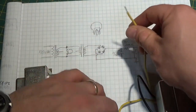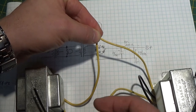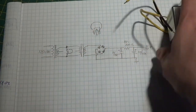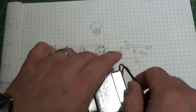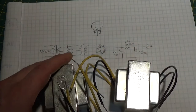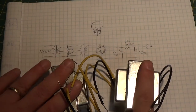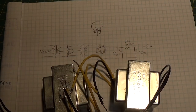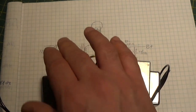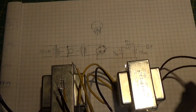In between these leads we're going to go to pin 4 with one set of wires and pin 5 with the other set. Now, from here to here is 12 volts, but after it goes through the second transformer it's going to step back up to your 125 volts again. This is not the most efficient way to do things — you're going through two transformers, and each will have a little bit of loss. We call it transformer losses, due to the resistance of the wires and the magnetism of the core. So what comes in this end will be a little bit lower when it comes out the other end — but that's not a big deal.